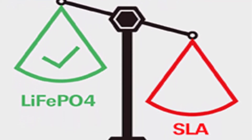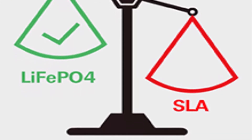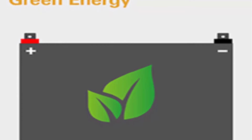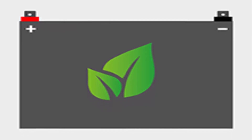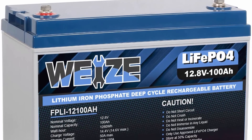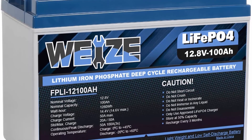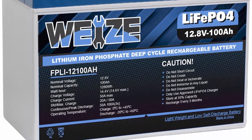Compared to lead acid, lithium provides greater energy density and is at least one-third the mass. It is a perfect upgrade for any 12V deep cycle battery and best choice for applications such as fish finders, ice fishing, camping, solar systems, home alarm systems, and e-scooters. Please charge the battery with a dedicated lithium battery charger, and use no more than four batteries in series or parallel.